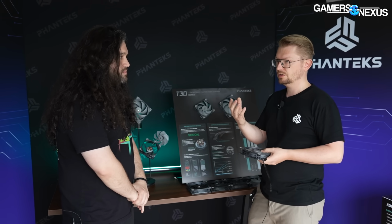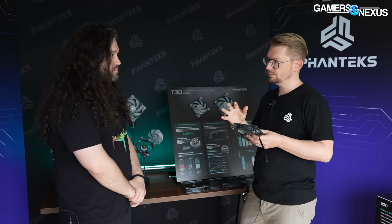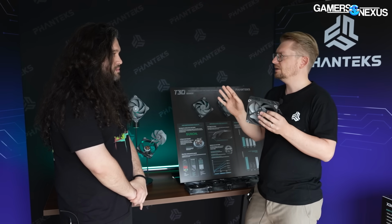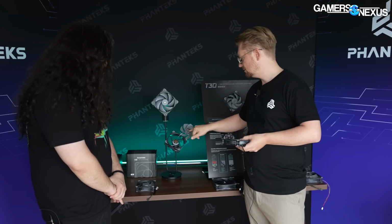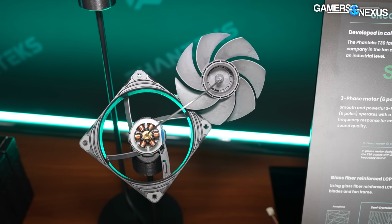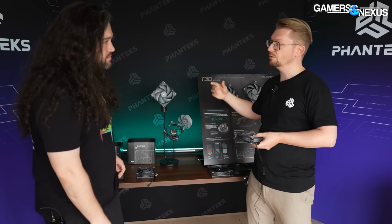So the steel surface in the tooling starts to erode, gets a little bit rougher, so it sticks a little bit more, and everything starts to deviate a little bit more. You can't prevent it totally, but you have to keep it in check because each of our fans is individually balanced. We've got two balancing rings, top and bottom, so you can imagine if the tolerances are increasing, like the weight distribution or it's slightly bent more and more, you have to do more and more balancing, and it gets out of control pretty quickly.